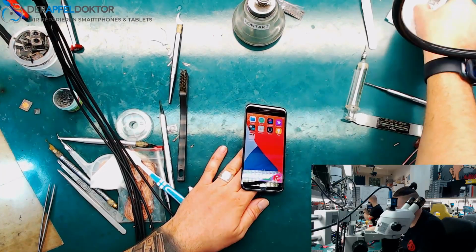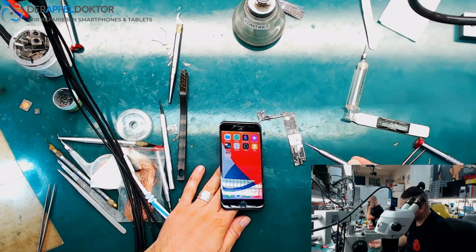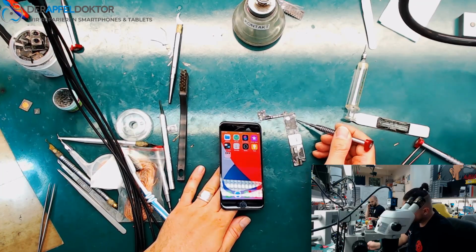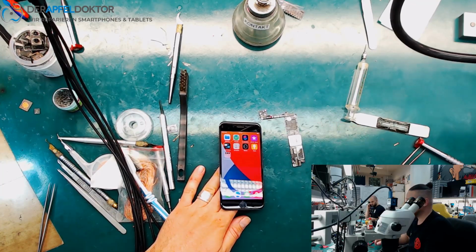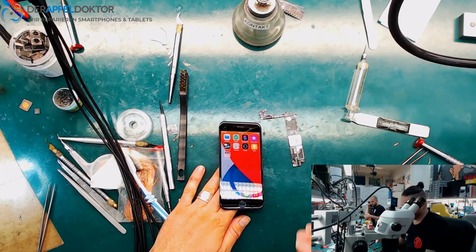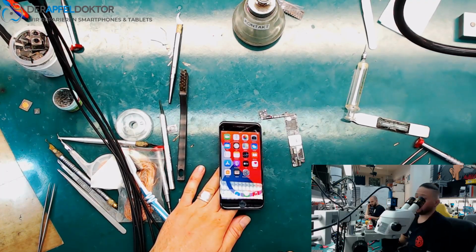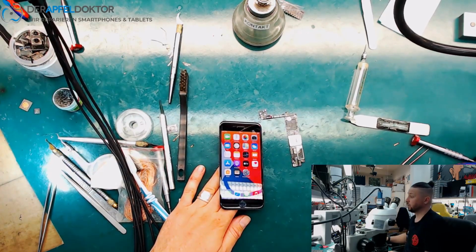So it was all about ripped components completely around the FPC here and next to the CPU here, and these coils were loose because somebody used too much heat in a repair, and so we fixed that by just swapping the whole board, and it will work fine.